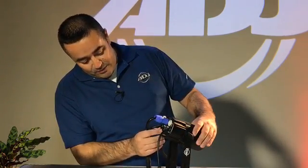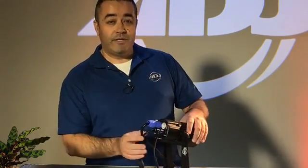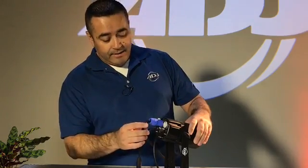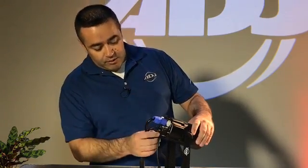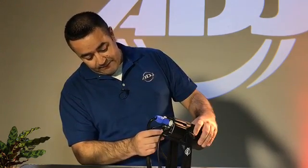So we continue, and the last mode is the No DMX mode, which allows you to tell the fixture how you want the fixture to behave in case there's no DMX signal going into the fixture. There's 3 ways you can have the fixture behave. There's a no light, or hold, or auto. And based on those 3, you can select what mode or behavior you want the light to do if there's no DMX. And then finally, the temperature of the LED.